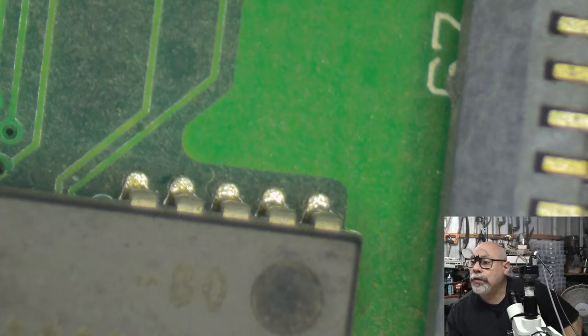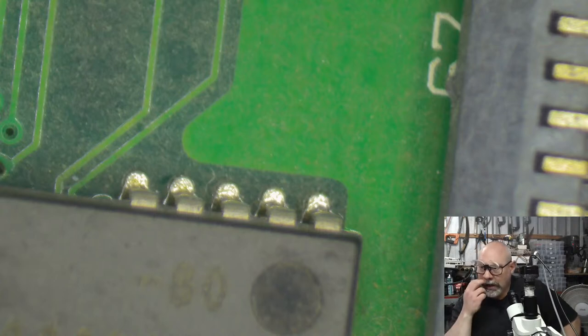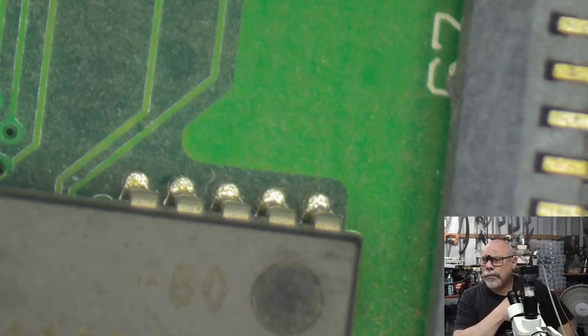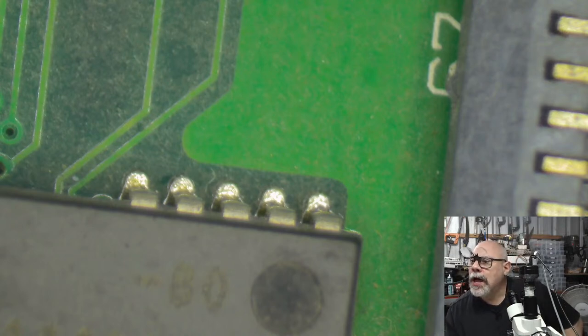Working on a PowerBook 165C. LCD has vertical purple lines in a 2-inch wide band. I replaced the capacitors except for the ones on the inverter board, and no difference. Yeah, I kind of gave up on some of those display issues. I've got a 180 or a 160 or something over there, still in pieces. I was having a similar problem with lines, and I ended up giving up on it. I'm sure it's fixable, and I'm sure I'll find it eventually, but it's just one of those projects that I put to one side because it was taking up so much of my time.